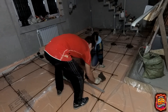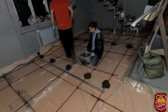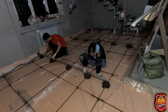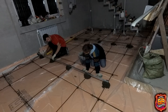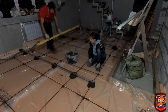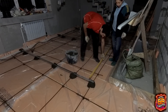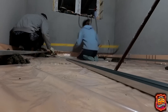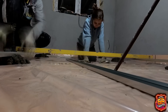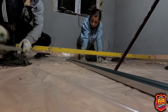Now it's time to install the beacons. I start installing beacons from the highest point in the entire house, and from this room I move in the direction of increasing height difference in the screed. The smallest screed reaches 4 cm, the largest 14 cm. First we set one beacon level, then install the second one parallel to it. Otherwise, if each beacon is set individually and separately, there will be a height difference.